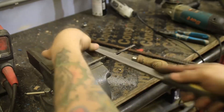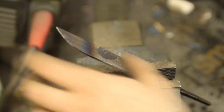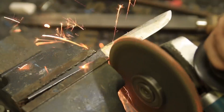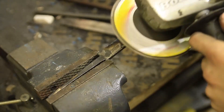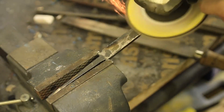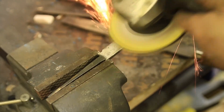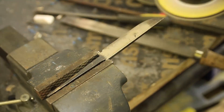Before hardening you can even work with a file, but the angle grinder is faster of course. Don't worry if you overheat the workpiece, because the heat treatment is up ahead. The outer race is fancy because of its figuration — it has a wedge-like cross section, so I think it's easier to make a chisel grind blade out of this workpiece. Only one side would be sharp, like on a chisel. You can use a rough rotary file or a flap wheel even with finest grain — it'll be easier to polish if you want to. I actually don't like shiny knives; they have to remain kinda DIY. Like a shiv!